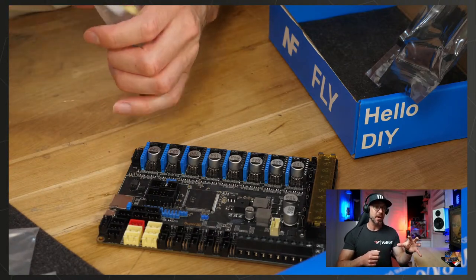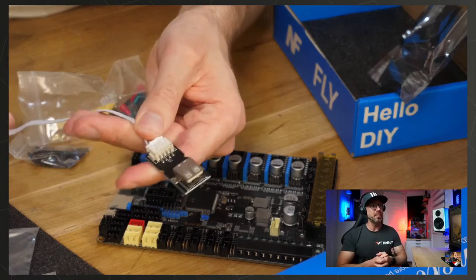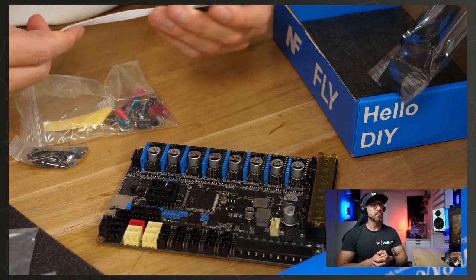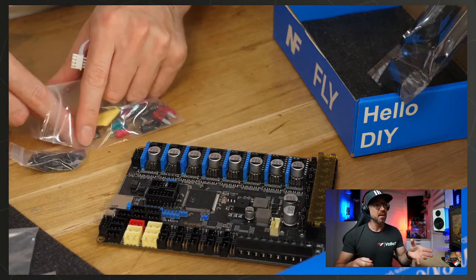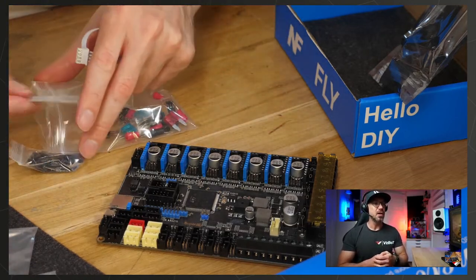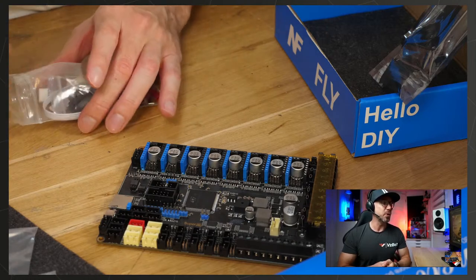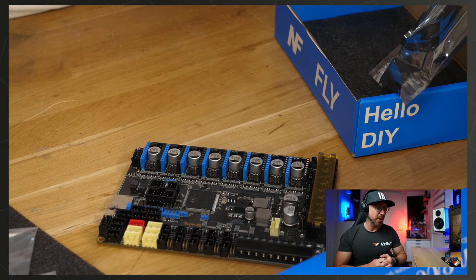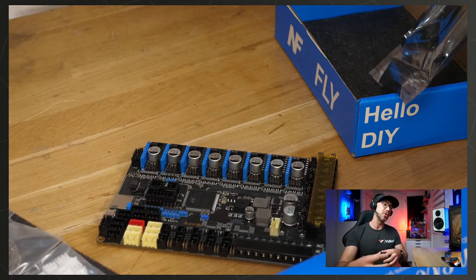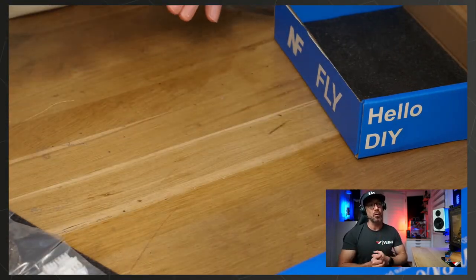There's a CAN port on this board which transfers to USB to feed the Raspberry Pi. One thing to note: if you have a DSI screen powering up through the Pi, you need to add a bit more 5V on top of that. Adding a USB camera on top of everything means it's all driven from the Pi power, so you need a very good power supply — or you can use an external power supply if you prefer.